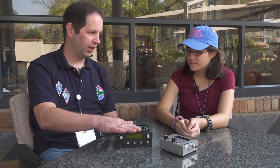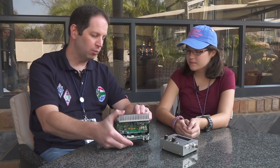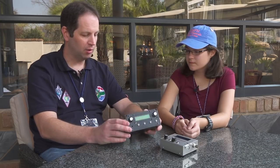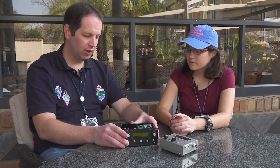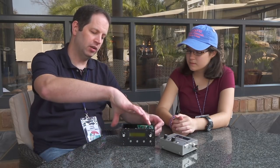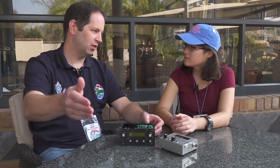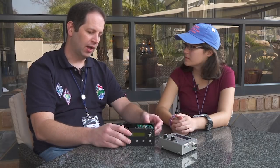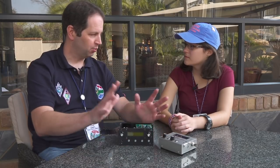This radio will do CW and SSB already — it's got a built-in CW keyer with raised cosine envelope shaping and a slot to plug a paddle in the back. So this does CW, sideband, AM, FM — all modes. Over the next couple of months I'll also be designing a plug-in filter board so it will cover 10 bands from 160 meters to 10 meters, including the 60-meter band, making it a complete all-band, all-HF, all-mode radio transceiver at 10 watts output.